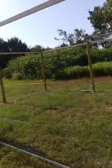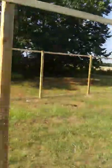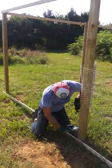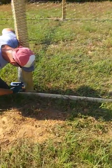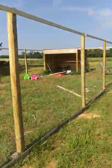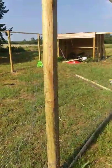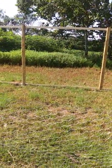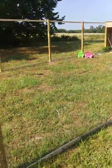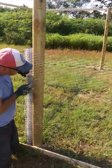All right, this is what we've done in the last couple of days. I didn't shoot a video when we were putting the tops and bottoms on, but we got that done in about two days. Today Dan is staple gunning up the chicken wire we bought — 48-inch and 36-inch — which will make it seven feet tall. We'll do half the post height, then come back and put a board between each of these eight-foot posts vertically so we have something to nail the wire to in the middle and make it more sturdy. We'll also have enough chicken wire to do the top.